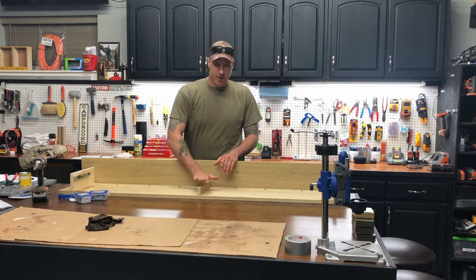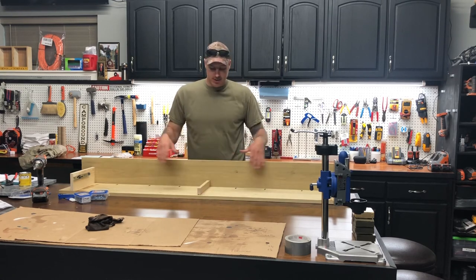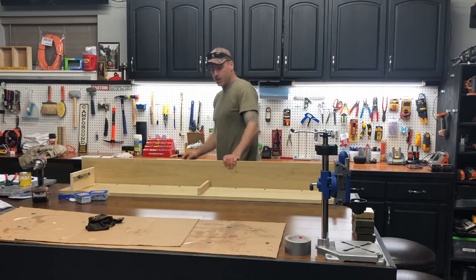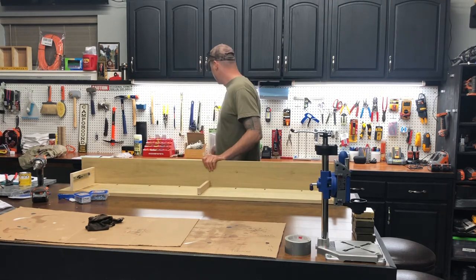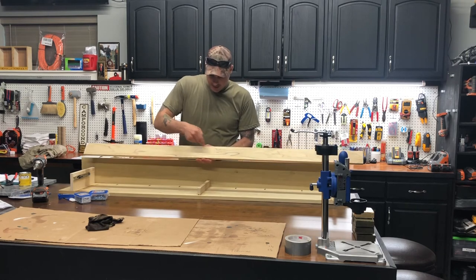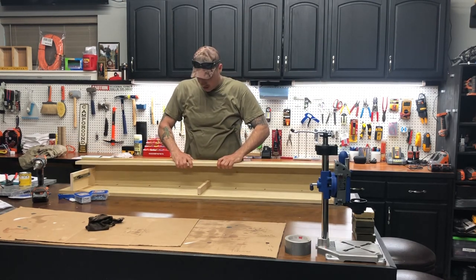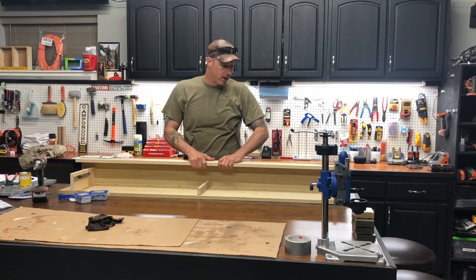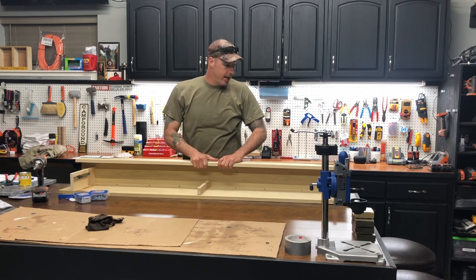I tested it and the walking issue went away. If you're installing between two cabinets, give yourself some sort of center guide — it doesn't affect the look since you can't see it, but it works. The last thing to complete the project is I measured from the face of the inside of the mantle to the face of the fireplace — it's three and an eighth inches — so I cut that piece and I'll put about eight pocket holes all the way down, clamp it, and drive the screws in. That completes the mantle aside from staining and optionally adding a poly coat.